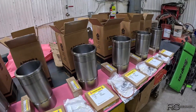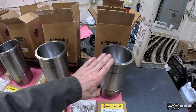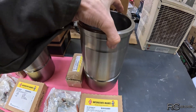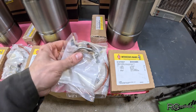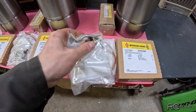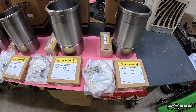There's our new mess that we've got to work with. Every one of these liner kits came with the liner and the piston installed in the liner, but there's no piston rings on it - that's just for packaging. We got our package of piston rings, and they actually came with new piston cooling jets, which I wasn't expecting. And of course we have our liner packings, the snap rings for the wrist pin, new wrist pins, new pistons, and new liners.